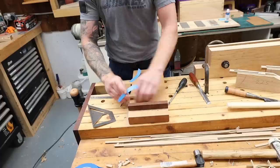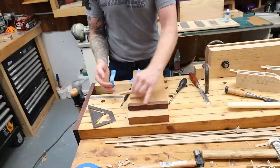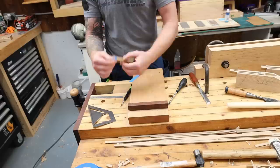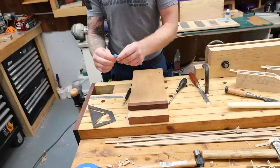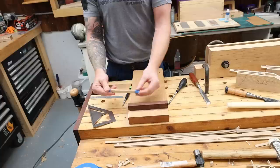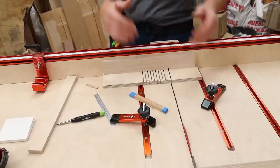I'm taking a small piece of masking tape, splitting it down the middle, and taping the ends of the strips together just to hold them all as one bundle. When we put them in the jig and the crosscut sled, we're cutting all of them at the same time. You can absolutely do this with a bench hook as well — the method is the same. Taping them together ensures everything lines up perfectly. There are our six sticks to make our grid.